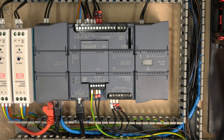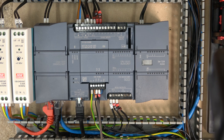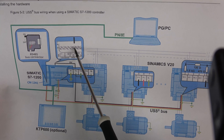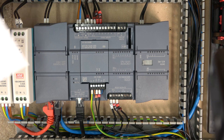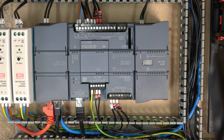These protections are there to protect your line from EMC interference. M is your earth. TA joins up to TRA, which is the first RS485 cable — the A cable. Then we have the B cable, with RB and TB joining up with TRB as well. Also, as you can see in the diagram, they run the 24V negative out of the PLC to the drive's zero volt point. That's how this card is wired. Next, let's jump to the drive and set it up for communication with this card.